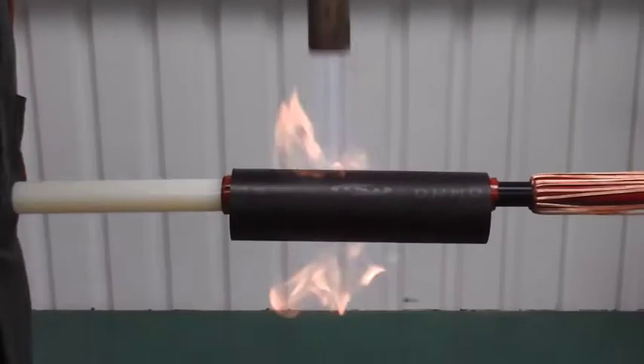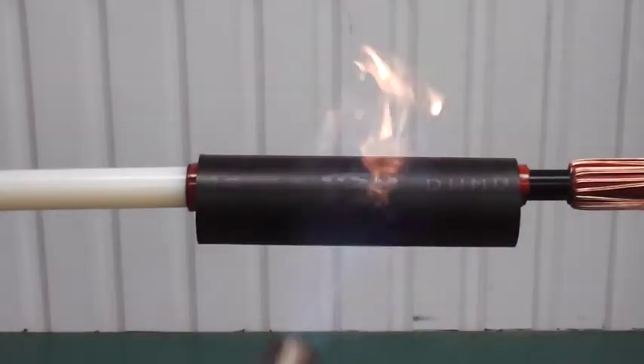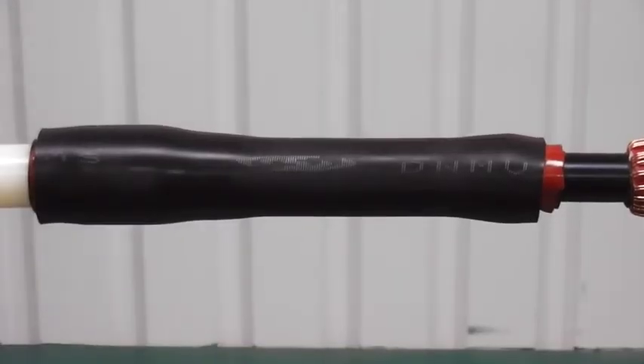Now this pot end is 12kV rated. At 17.5kV, 24kV and 36kV there will be additional red mastic tape, insulation filled up layer tubes. Shrink from the centre to one end at a time until fully recovered and wrinkle free.